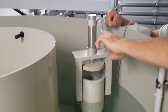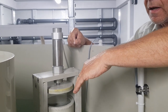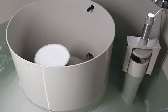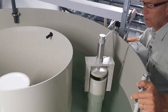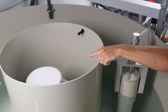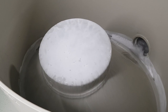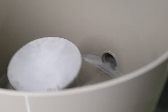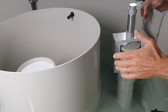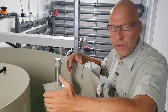This valve — this piston closes this tube for a few seconds, the outlet, and then the water releases here, lifts by airlift to the sludge. I do it now by hand so you will see this. You see the fine bubbles come out of the center by airlift. Normal operation — it's in an automatic mode. It can be adjusted by the clients, with training from us, how often it is done.